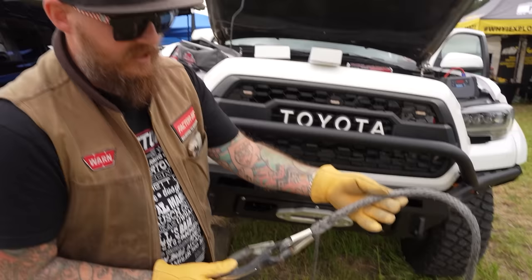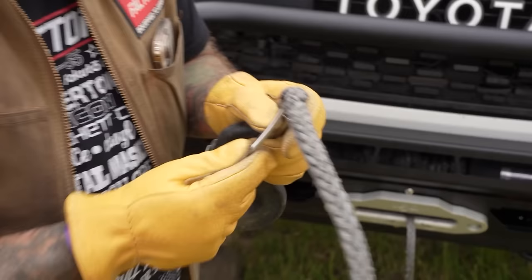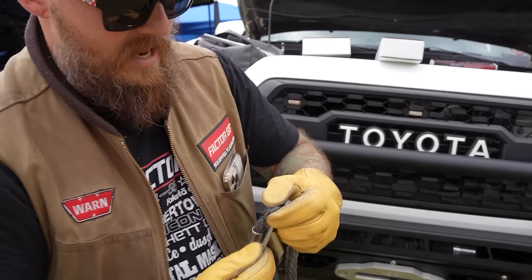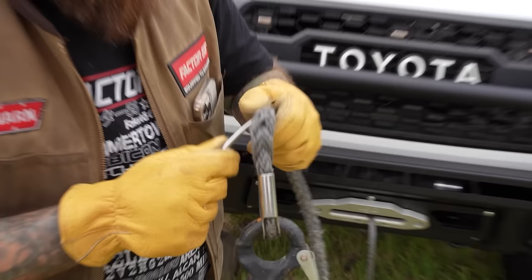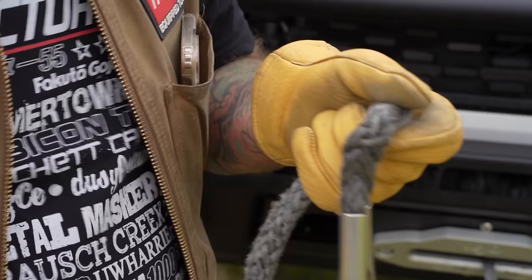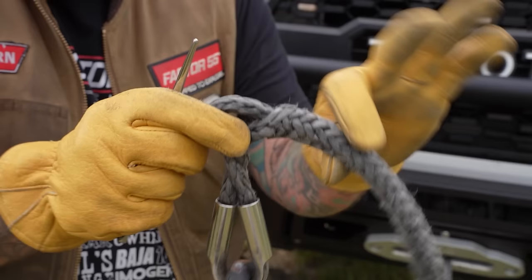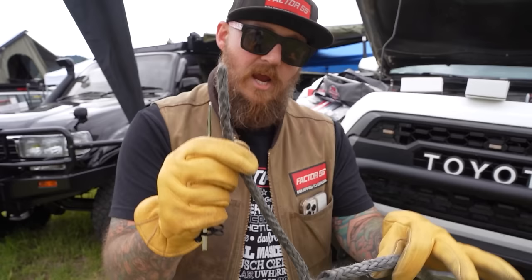If you have an eye of rope like this and you want to get this out, you want to save as much rope as possible. You can take a Marlin spike or the end of our fid needle and go through here to pull the tail of the rope out. You can see I got right underneath that fiber where the tail is going in. It just slides right off — the tail is right out of there. It was buried down inside of itself, and you can just pull the tail right out.